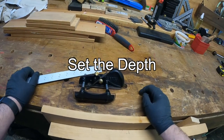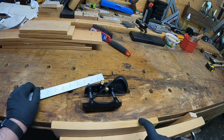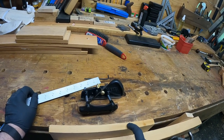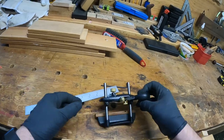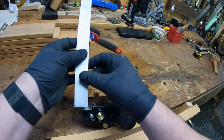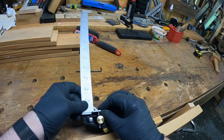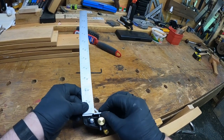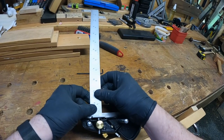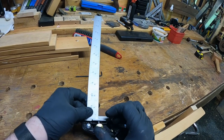So we're going to set this up to do a quarter inch groove on the long grain side edge of this board. The first thing we need to do is set our depth stop to a quarter of an inch. It's pretty easy to do with this plane — there's a quarter of an inch. There's our depth stop; let's double check it. There's a quarter inch. Okay.